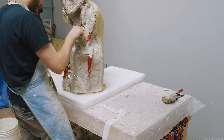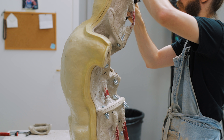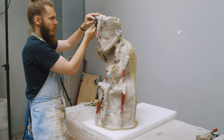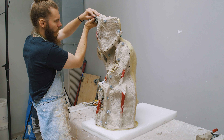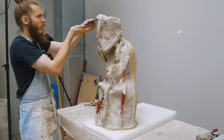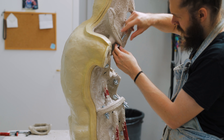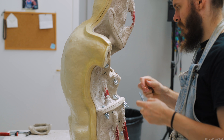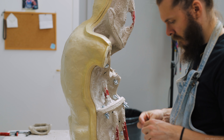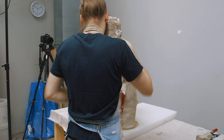I don't want to take any chances at this point, so even though the hydro-resin casting is going to be very strong, I work thinking that it's not as strong as it actually is. The bottom of the casting is important to me, because it is the thing that registers to the flat bottom of the silicone, which means it's more or less level with the floor or any base I might put the piece on. Should I break some of it off, it might turn out to be more difficult than necessary to make the piece sit level on a base. I'd like the original configuration, the way it was sitting on the sculpting stand when I sculpted it, to be the way that the bottom of the piece registers to the ground once cast as well.